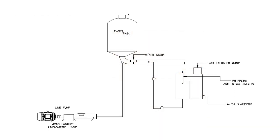This is a setup in Cora, Texas. They have a progressive cavity pump which meters the lime, again on a VFD, right past the flash tank. We inject lime before the flash tank at Westfield; in Cora, Texas, they do it after the flash tank. They again have obstructions — basically pieces of plate to promote agitation. They collect a sample past the agitator, and the sample line goes into a chamber where they have a pH probe to detect the pH, then make adjustments using the VFD, speeding up or slowing down the pump.